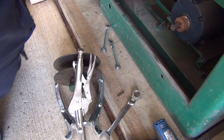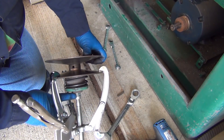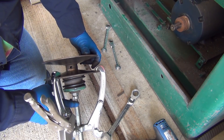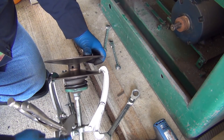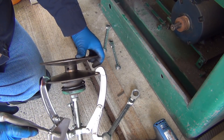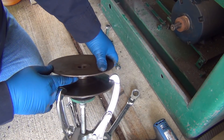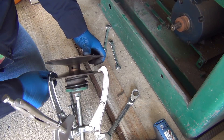I took a big gear puller — you can see it there. I put a nut in the end of the shaft; there was a chamfer inside so it sits in the chamfer and centers itself, and that allowed the gear puller point to center. This clamp here is because I'm missing one of these bars — it broke, and that's been on the list of things to do. Once I got it started and got some pressure on it, I clamped it with vice grips, and you can see down in there the set screw — or rather, the lack of a set screw.